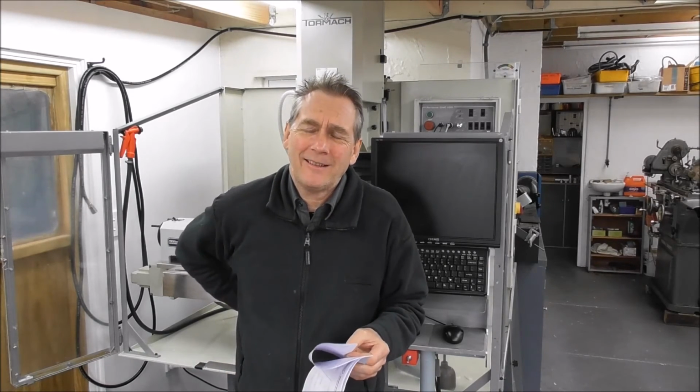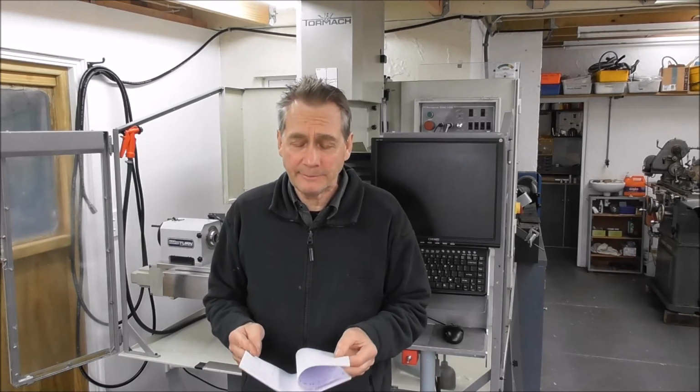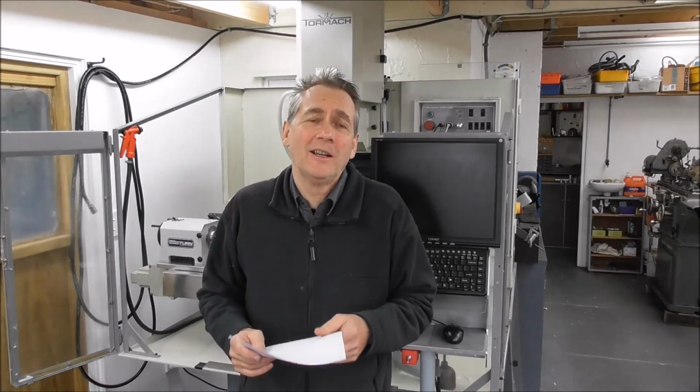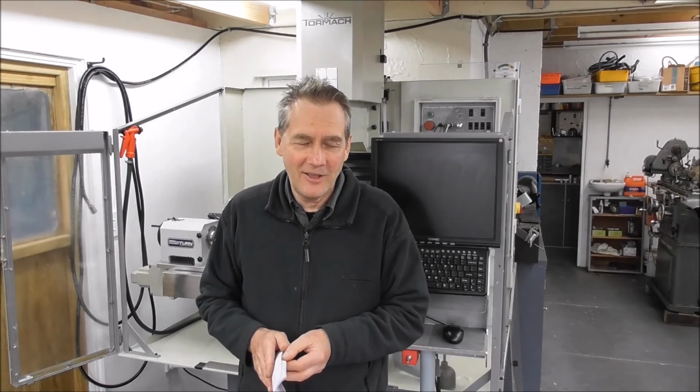There's a couple of things that are slightly out of spec. Well, the spindle bore is slightly too large by the Hardinge specifications, but you know, only slightly, only half a hundredth of a millimeter. And there's a little bit of bearing noise, which may be just an adjustment issue. Time will tell. Isn't that life though? You know, 2 steps forward, 1 step backwards. Nothing ever goes 100%. And engineering's a bit of an analogy of life, isn't it?